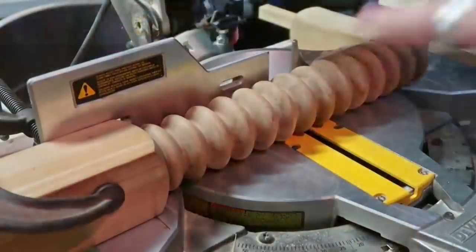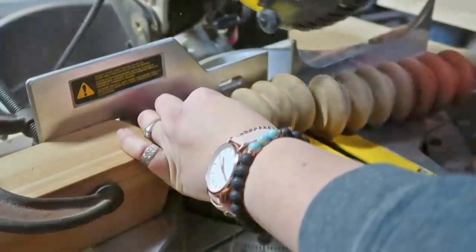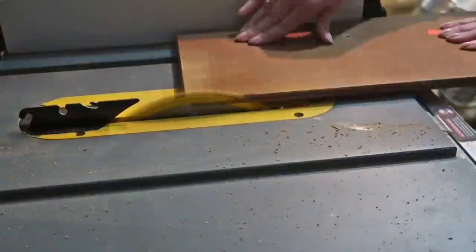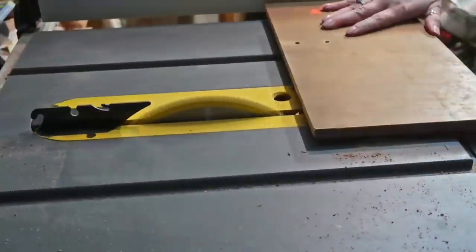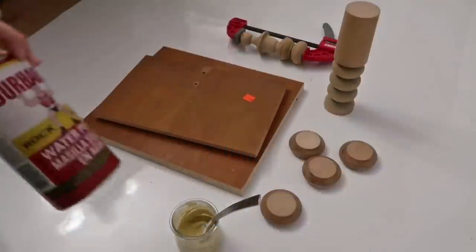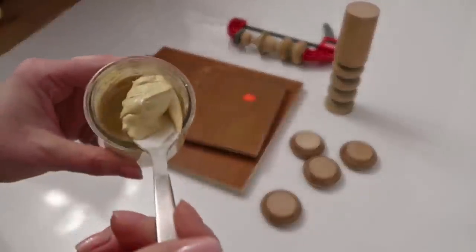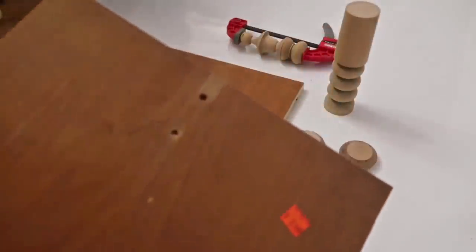You are going to want to let that dry for quite a while. As that was drying we went ahead and cut the rest of the spindles and the smaller cabinet door for the top of the tiered tray. Because the cabinet doors both had holes from the handles in them, I'm just taking some wood putty and filling them in. You're going to want to use more putty than you think you'll need because as this stuff dries it really shrinks.